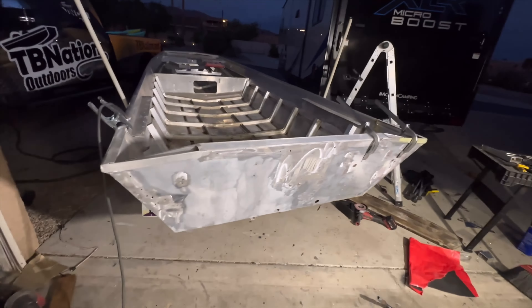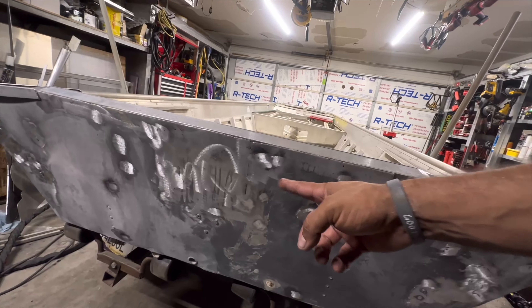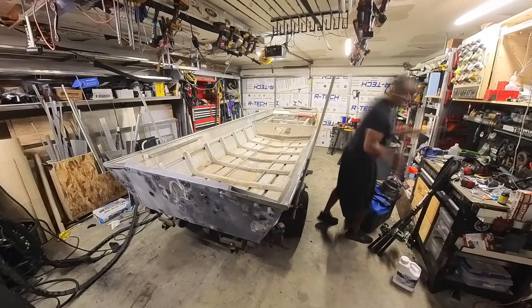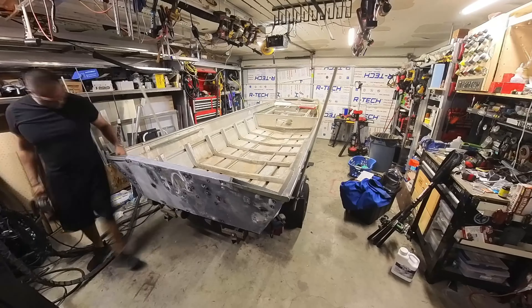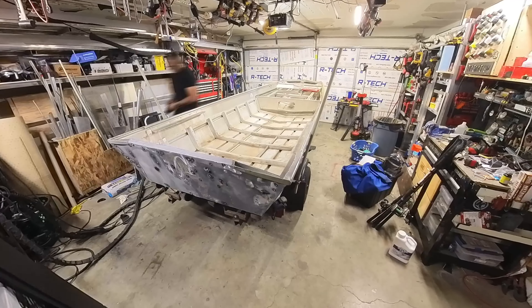Once all the welds were going, it was pretty tough. The metal was thinner in some parts than others, so the thickness of the parent metal wasn't exactly what I was welding into and I constantly had to adjust. In thinner spots it would just blow right through, then I'd get to a part thick enough to weld where the weld puddles became more obscene. It started to flex, so I had to put rivets and screws into spots I didn't want to just to hold the metal and keep it from bowing out with the heat. This is all those little tacks welded directly to the transom, so the backup part is welded directly to the new aluminum. I did mess up a few times.